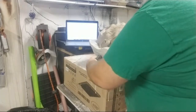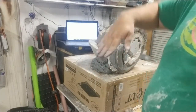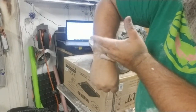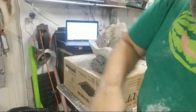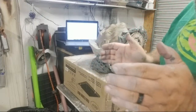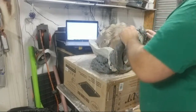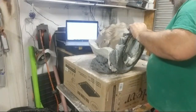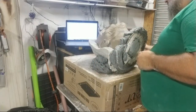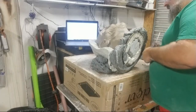I mentioned a mold lock. Imagine plaster that's about to harden into stone and you put your fist into it and then it hardens around your wrist. This level and all this is plaster. Well, you can't pull that out because this is thicker than this. So if you're going around like the neck of your sculpture, you want it to be exactly half so that it pulls away freely. If it's more than half and it's grabbing on to that plaster neck inside of there, then you can have problems. Meaning a mold lock. It is possible to lock the two halves of this mold together so well that it doesn't come apart. At that point, you've made a decorative rock more than a mask mold.